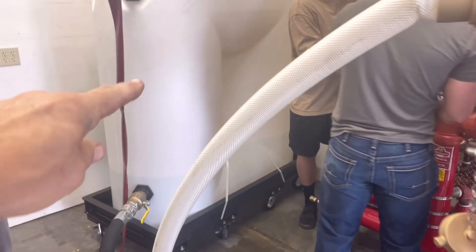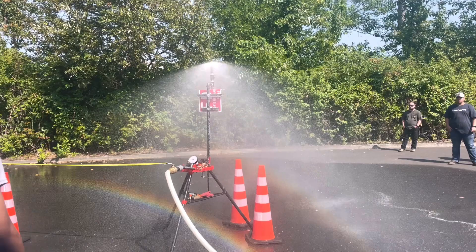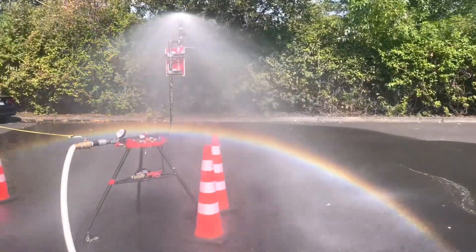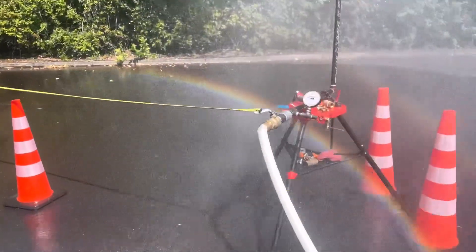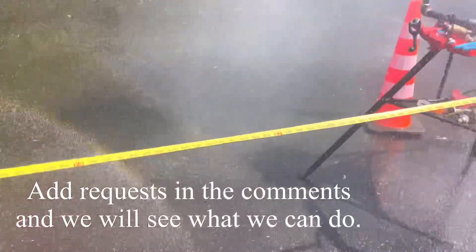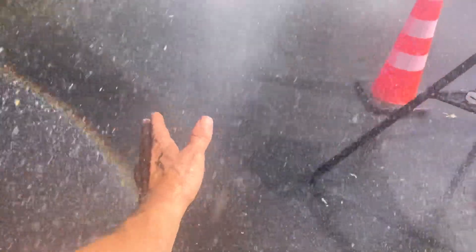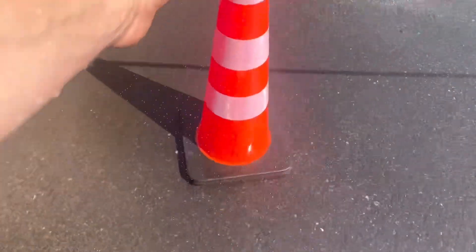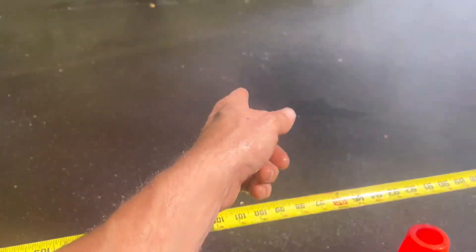Those three heads used close to 200 gallons of water, maybe 150 or so. Here's the standard 5.6k upright sprinkler at about 60 pounds residual — 55 pounds. You can see it's out to about four to six feet right here, and further down the ground. There's your seven-foot-six mark, and you can see where the water's hitting. It won't spray much more than what we say in the code book.